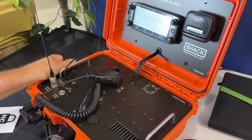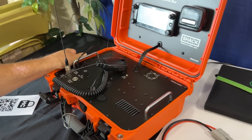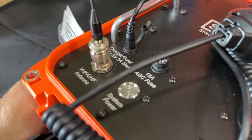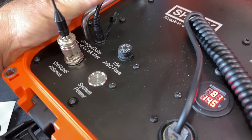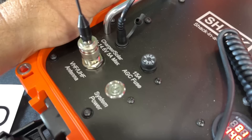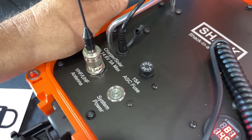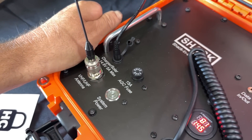They can build it with the IC-2730A and are going to try with the FTM-500, though the face panel may be a little deep. The FTM-500 has a UHF connector instead of an N connector. The fuse is an AGC glass fuse, so you don't have to take the cover off to replace it — the IC-705 version will have that feature as well, replacing the current inline fuse.